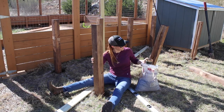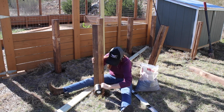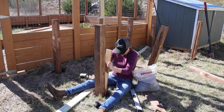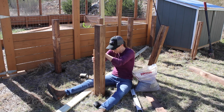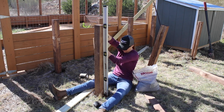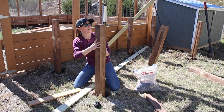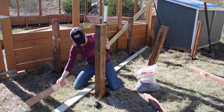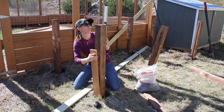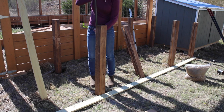I didn't feel like messing with concrete so for this project I'll show you an alternative which is decomposed granite. This stuff comes in a bag and can be found in the garden section. On every post I fill the hole up about a third of the way and then tamp it down. I prefer to use a short scrap — specifically a one-by — so I can fit in the tight spots around the post. I'm going for enough compaction to keep the post from leaning so that I have both hands free to place a level on one side of the post and push it plumb. I have a rock bar and it comes with a two-inch round tamp on one end, so that's what I use.